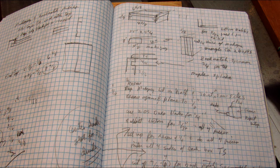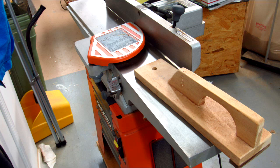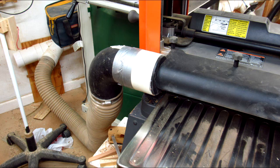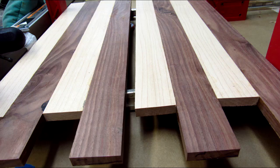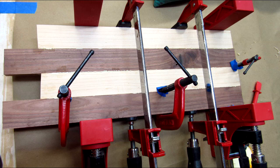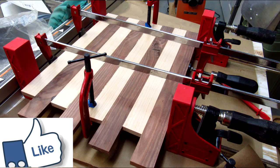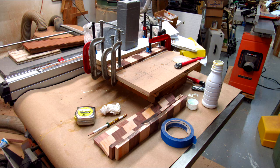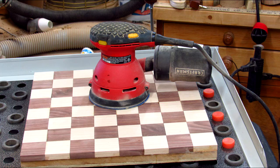It's always good to start with a design. I had some sketches of where I was trying to go with the box and the board. I pulled out my router and my planer — I had to plane the boards. I had to cobble together a dust collection setup since I don't regularly use this planer and joiner. I planed these thin strips and glued them up, first in sets of four, clamped them — you can't have too many clamps. After finishing sets of four, I grouped them into two sections and glued them up. After that I started scraping to get rid of any glue and smooth the surface. I then cut the strips crossways, reversed every other one, and started gluing them up on the substrate, trying to keep them flat, which is a challenge.